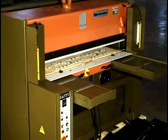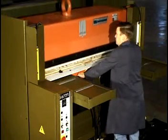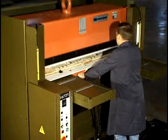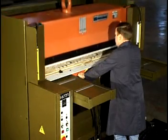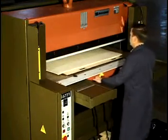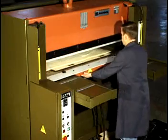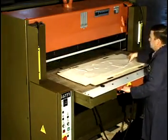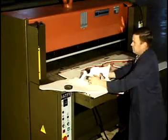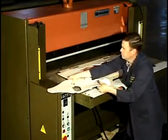Points of strength. The single cylinder hydraulic mechanism guarantees maximum parallelism and uniformity of cutting force distribution. Positive head stops for maximum cutting accuracy. The single sliding manual work tray is made of heavy duty phenolic. The cutting die can be placed either on the tray with knives up or attached to the head of the machine with movable die clamps. The sliding tray gives the operator increased visibility for accurate material and die placement.